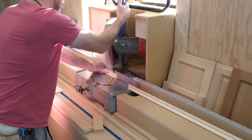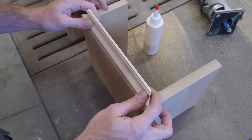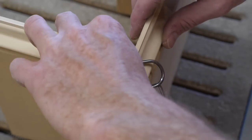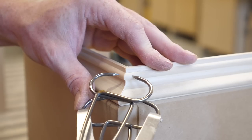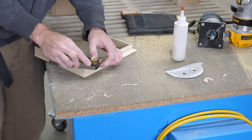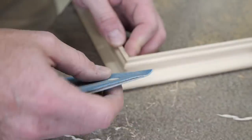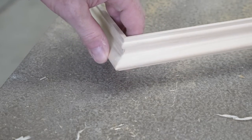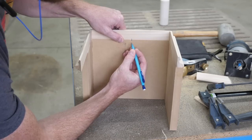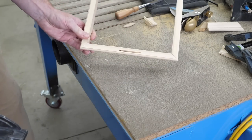I add a quarter inch quarter round to the top of the shoes. Then it's time to gussy them up with some molding. Some glue and Collins miter clamps are the coin of the realm when it comes to installing moldings. I have glued countless miter joints this way and I have yet to have one open up. I use a block plane for flushness and some sandpaper to clean off any glue and perfect the joint. Sanding also seems to remove most of the dimples left from the clamps.